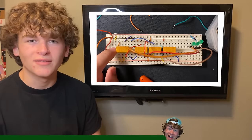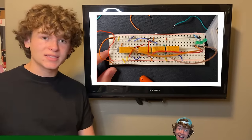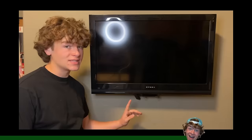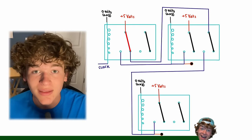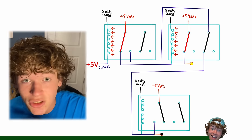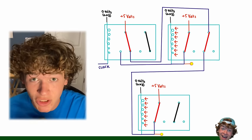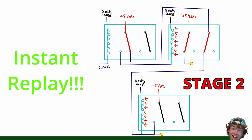This is a very important circuit I've just designed. It takes a clock input — high voltage, low voltage, high voltage, low voltage — on a steady timeline. In this simplified schematic with two stages, lights turn on when the wire they're attached to experiences five volts. When the clock goes to five volts, the relay latches on just like our data storage. Then when the clock is low, a second signal is sent through that latched relay to latch the next relay — the second stage. That's how I designed the sequencing circuit; for four stages, I just did it twice.